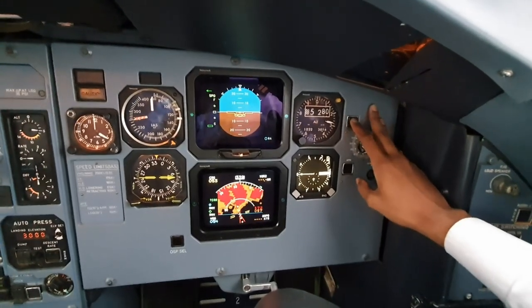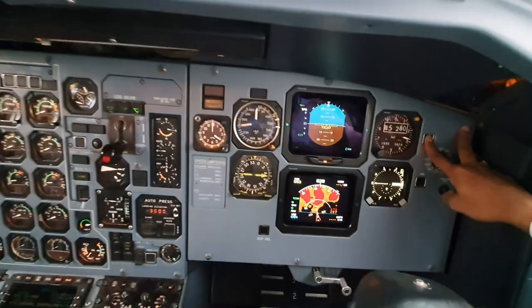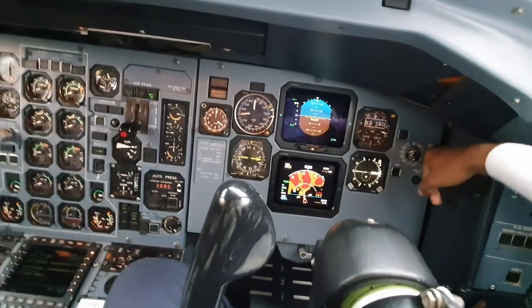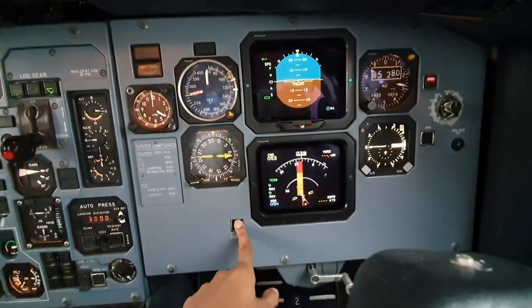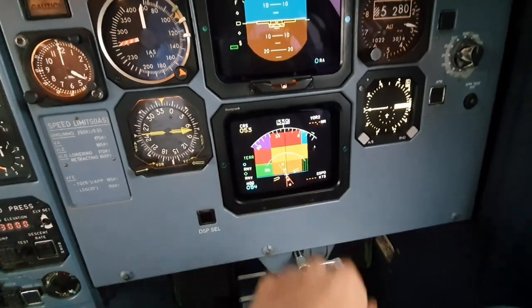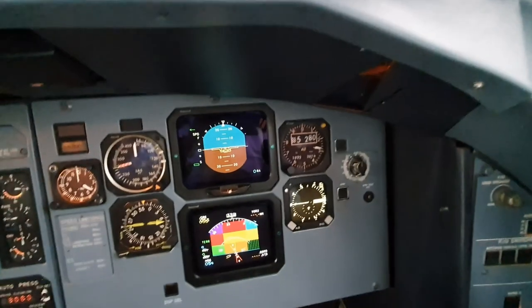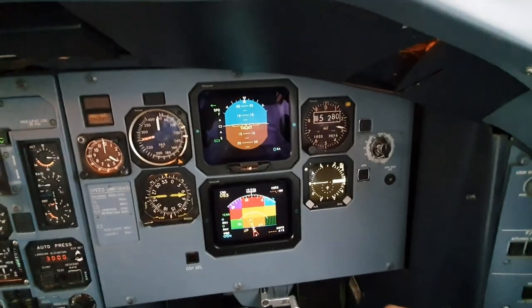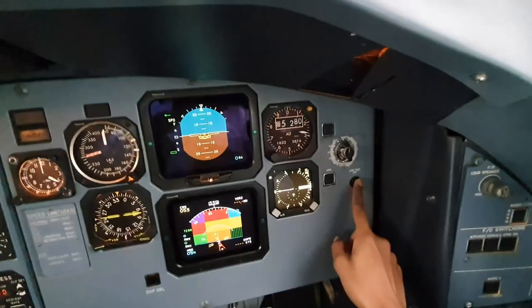The next test is the GPWS. Just press and hold. Glide slope. Pull up. Terrain ahead. Pull up. And the testing would start. Pull up. And it would appear terrain as such. Pull up. We can continue the other tests. Don't sink. While this is testing. Too low, terrain. We can do the APM test. Too low, gear. Press the APM flaps test push button.